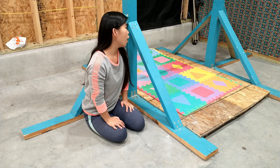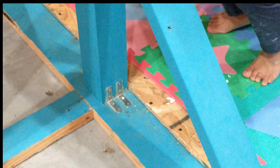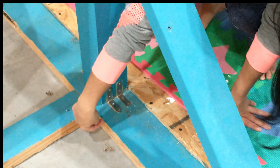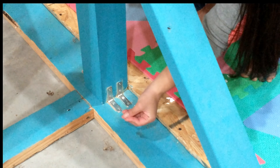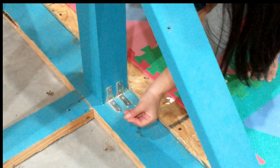To get these sideboards to stay in place at the base boards — which are 6 feet long — when I put them together at the bottom, I screwed in 4 screws making a square at the bottom going up through the board. So 4 screws on each side equals 8 screws total. Then also in the base in the middle, I did 90-degree brackets.